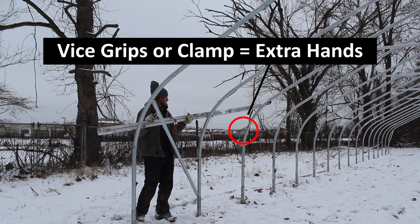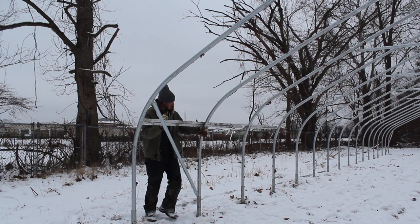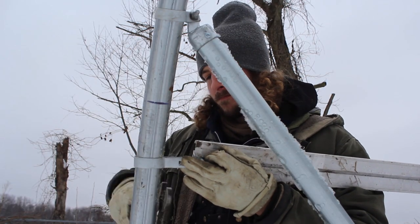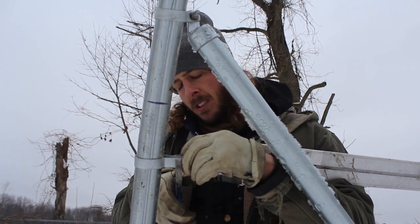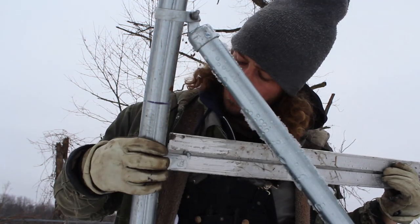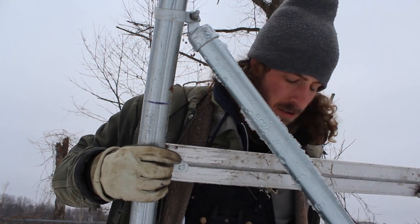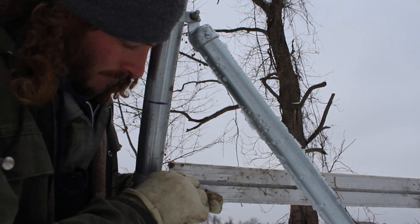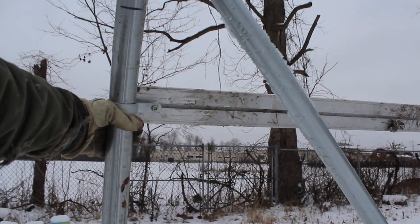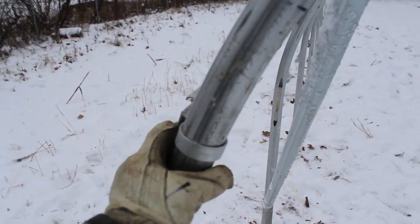To make it easier to put the double channel in place, we have vise grips attached to the hoop itself — they act as another set of hands when we're putting things in place. We're going to line up the hip rail with the tension band we previously installed. We're going to crimp the tension band with the channel locks to bring those holes closer together, and both the flat side and the crimp side will be on the interior of the structure behind the hip rail. We're going to line up the holes in the tension band with the bolt in the slot on the back of that double channel. Once those are lined up, we're going to thumb tighten the nut — we're not going to permanently tighten down quite yet, as we want to make sure the double channel is seated as it should be.